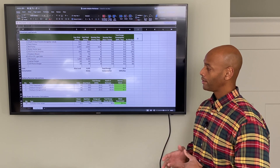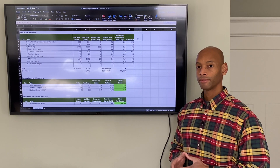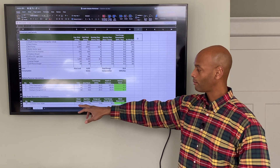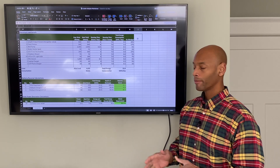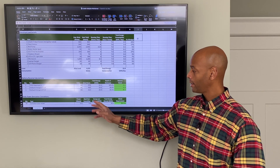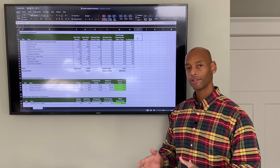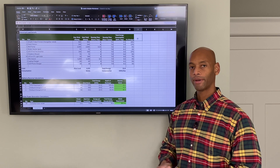In the example we're doing here, this is a 9.8 kilowatt solar system. At the bottom of the sheet we have our solar power information — this example uses 30 325-watt Canadian Solar panels. Here in central Virginia we get about 4.8 hours of sunlight per day, so based on the solar power and insolation at this location, we're looking at a total energy harvest on average of just over 46 kilowatt hours per day. This number is important and we'll come back to it.